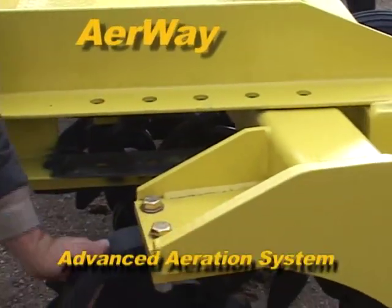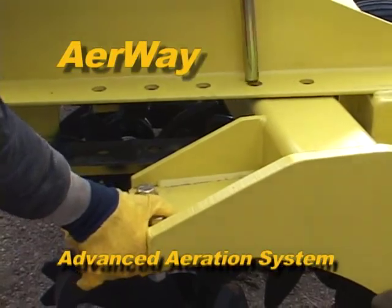You see the rooster tail of dirt coming off the back of the tines, that's how it mixes soil with the residue, covering the residue, intermingling the soil with the residue, helps it to break down much quicker. AerWay can be adjusted from 0 to a more aggressive setting for maximum tillage action.